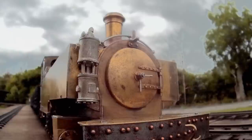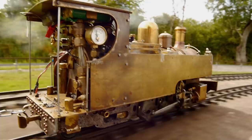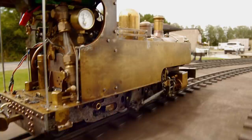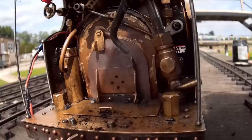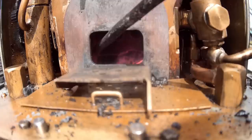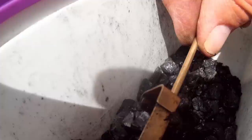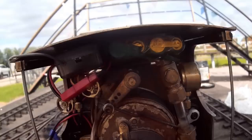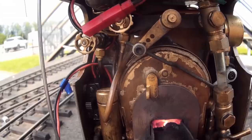I love seeing the train speeding along and hurtling down the track. After five or six circuits it's time to feed the fire with new coal. I have to resist poking around in the fire too much and disturbing it. The steam sound is the blower. It's not easy holding the camera as well as firing the engine. I have to be careful not to leave the firebox door open too long, as the cold air will kill the fire in this small firebox.